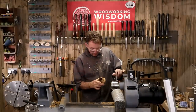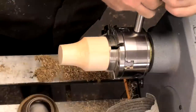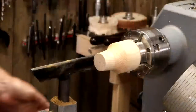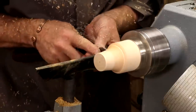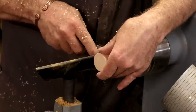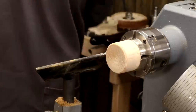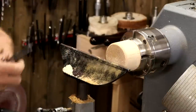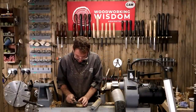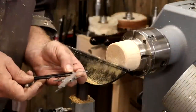Let's have a quick look — move it about, that looks clean. We want something to reverse it with — a jam chuck. So this was on the shelf — a bit of pine. I'm going to hack it about now. That'll be big enough. We want a parting tool — same rule as we did before: parting a lid and base, no tailstock. Hand to support it. Now with the dividers — we haven't changed them. If I was doing a series of boxes at home I'd measure them all. This one we know — we can re-measure. That goes back to Fuller's question: if we measure that, we have 52mm — 26mm — I want to bring them in, so 25, that's not bad.